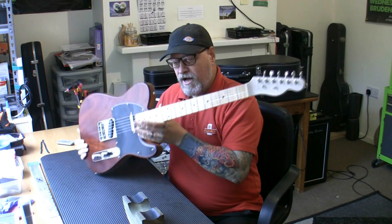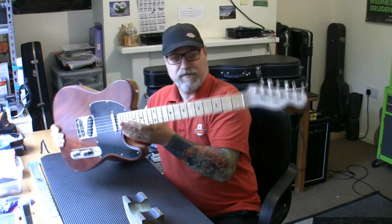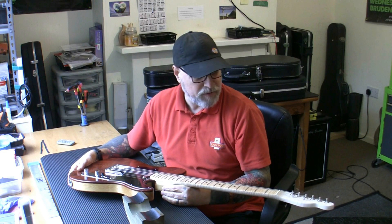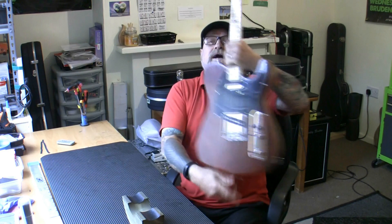He's only sanded it to 280 grit, so I'm going to sand it down to 400 grit and stain it — try to get it back to the colour of the fingerboard. I'll use anything I have to hand: turmeric, curry powder, coffee, tea, wood stain — anything that makes a colour. The headstock logo is slightly gone.